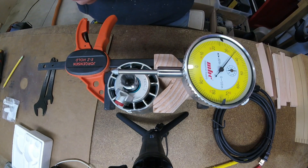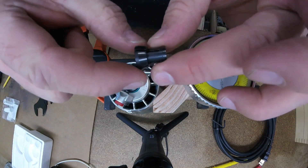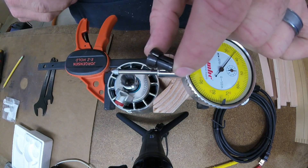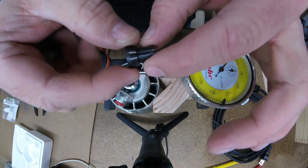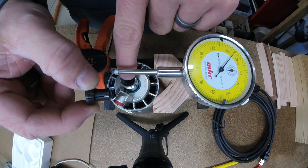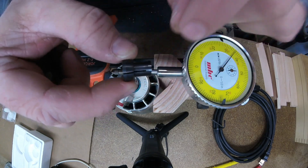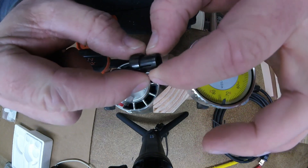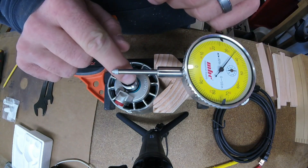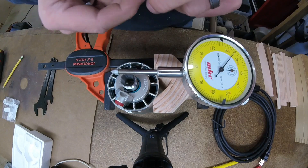We've got the dial indicator and base clamped up on the housing of the router. We've got the collet itself from the Makita router. This isn't like the ER-11 style collet where you've got the taper on the whole collet to locate itself — ER-11 collets are much more accurate than this style. I've seen this style on some CNC lathes, where this little shoulder locates down below the taper in the spindle. If there's any kind of slop there, it can cause the collet to not quite locate properly and create a little bit of runout. When you're doing this, you want to check the collet — especially if it's brand new — and make sure there are no burrs on the edge where they've machined in the slots.